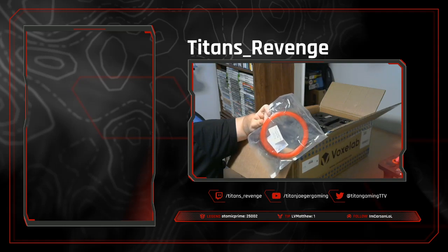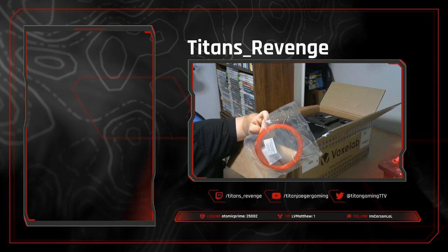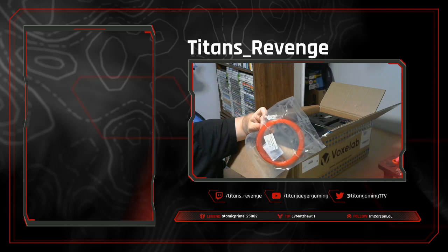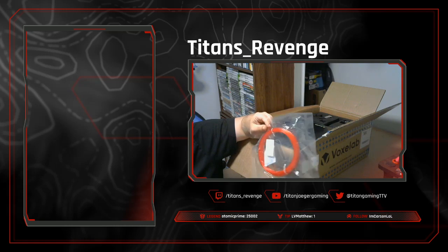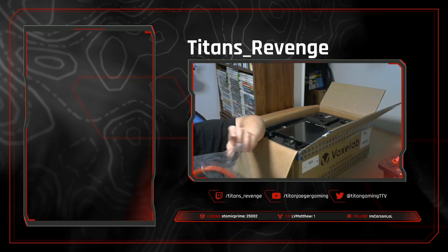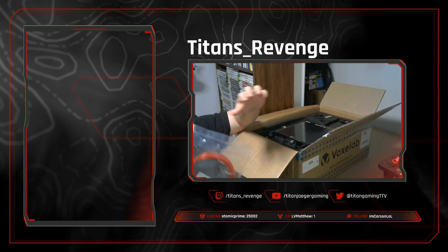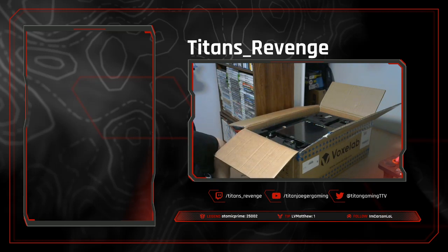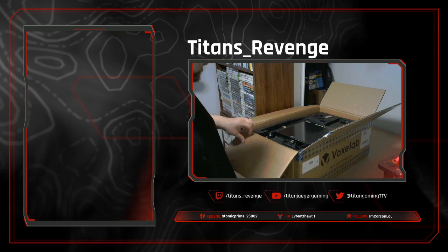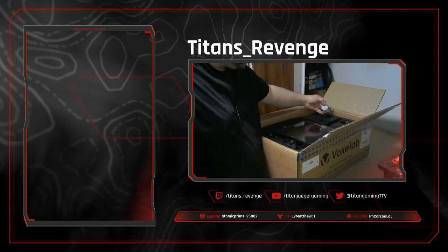Usually that stuff is things for you to print out to use right away. It's like a calibration tool that, depending on how it prints, will tell you if it's over or under extruding, putting out too much filament, if the temperature's too hot, or if it's stringing. And then there's a little hook you can print out, and probably the cooler thing is printing out the little toolbox. There's a file on there for you to print your own toolbox that attaches to the frame, so you can put all the little tools in it, because they send you a little kit full of tools. You could print the toolbox and attach it straight to your machine, and then you have your tools readily available.